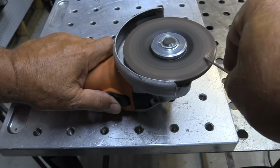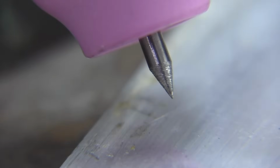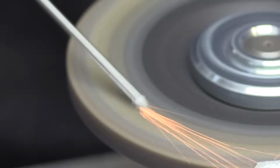When you're sharpening your electrode, you want to have all your scratches running lengthwise. I've done this a lot in a pinch, but for best practice, for best results, and for best arc starts, especially at low amperage, you won't get that if you don't have your scratches running lengthwise. Rough scratches and scratches that are running sideways can give you poor arc starts, and you might even make you melt a cooling fan off or something that you didn't intend to arc off on.